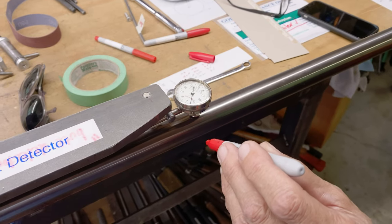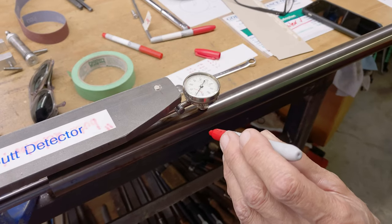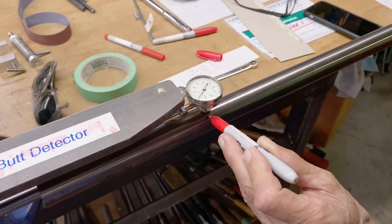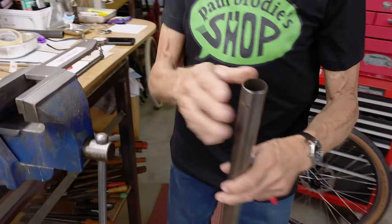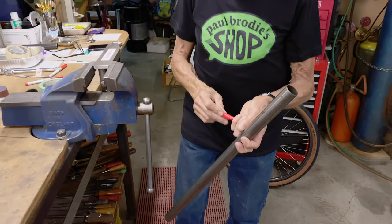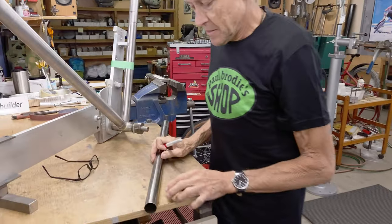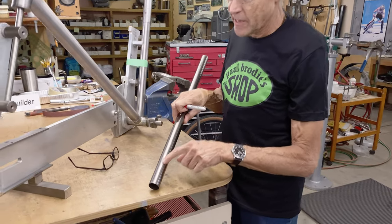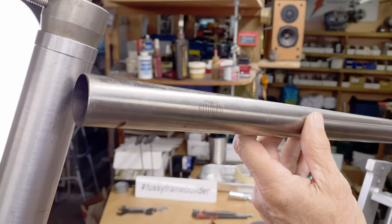See how this butt is much longer? Much longer. So there's a long butt side and there's a short butt side. Yeah, I thought that was going to be the case. On the Tange tubes, you can see the Tange logo. When we used to build frames, that always went up to the front — that's how we did it back then. We didn't have the butt detector.